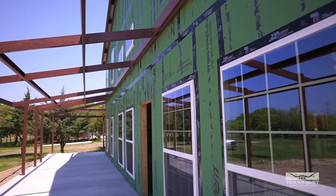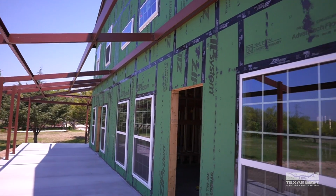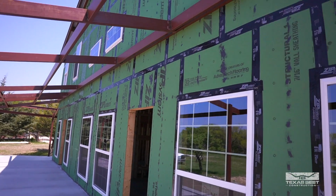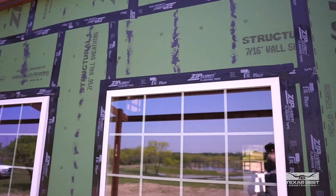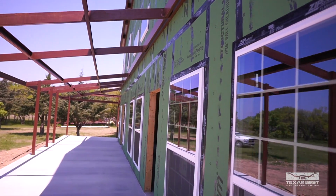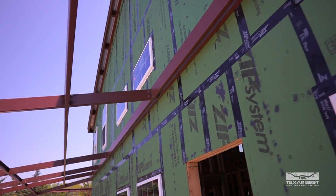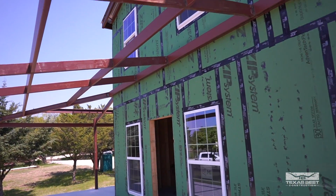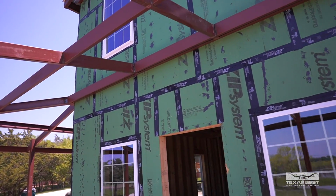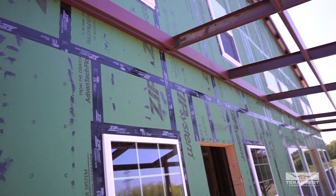One of the things here under the porch area, you'll notice I do this. So I like to have a solid green zip board going all the way down. These are full sheets behind, before we attach to the wall with this C-channel that we put here, tying our porches on. Reasons why we do that is we want to have a complete enclosed backer that goes behind the porch.